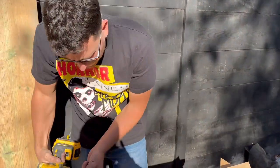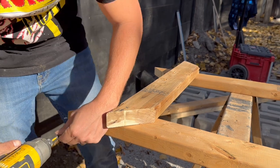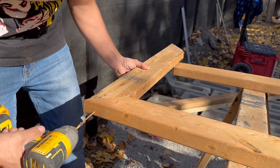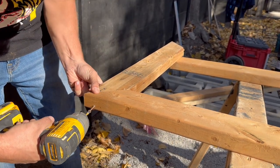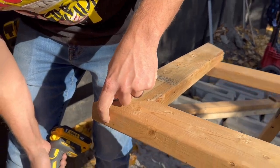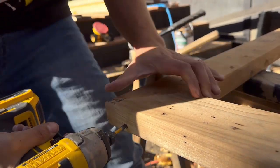We're going to take a couple of three-inch screws and here's how we put our picture frame together. I'm going to go down below the half mark of my picture frame. This one's advised that you pre-drill it because you don't want to split it — we're going low and close to the edge. The whole screw head is below the half mark. That's what we're looking for. Let's go do the same thing on all four sides, then we can toenail it in.